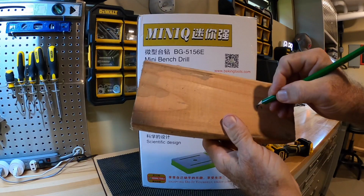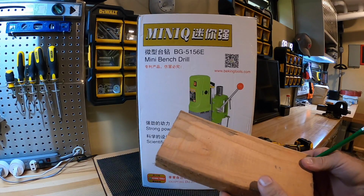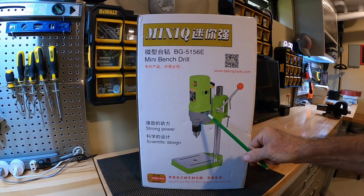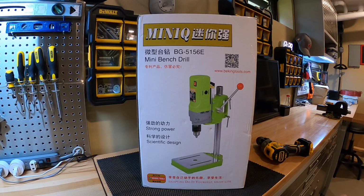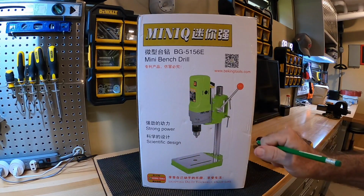The hole is over here, so when the screw head comes out on this side, it's not going to make it into the anchor. The only way that you can get 100% accurate is using something like this. Also, this works really well when you're drilling into something like aluminum or steel. Your drill presses are the best thing that you could use. Plus, you have a little bit more control on this arm right here with the pressure that you're putting down.